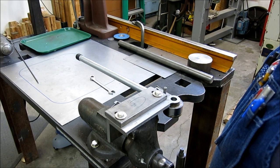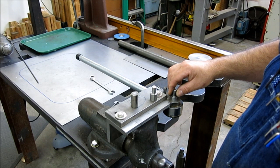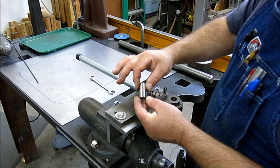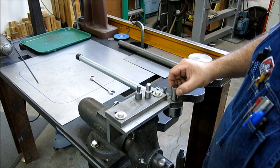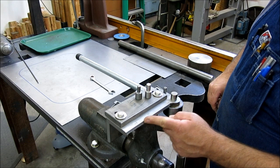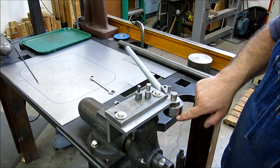I just want to show a couple of little accessories I've made for this. This is the pin that's in the plans here — this hole is oversized so you can actually just change and put whatever you want in here, but this is the one I've been using the most. This is three quarters of an inch in diameter, and I milled a little centerline on it, which allows me to have a reference mark in relation to the center of that. I've also added this little scale here. I got an idea for a ring that we can set at zero so that we can track how many degrees of bend — right now I just use a Sharpie on it, which seems to work fine.